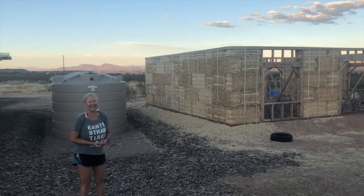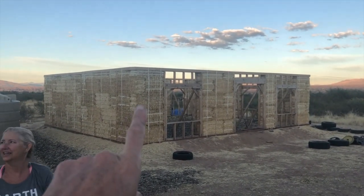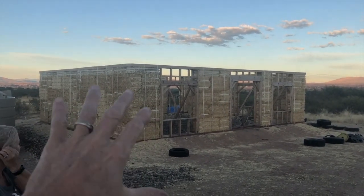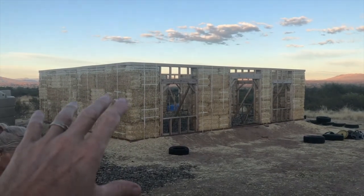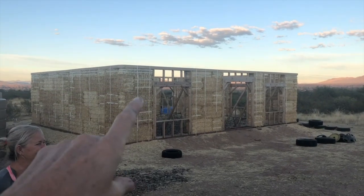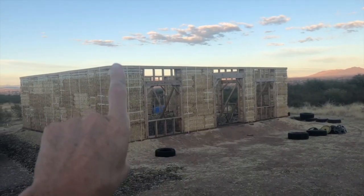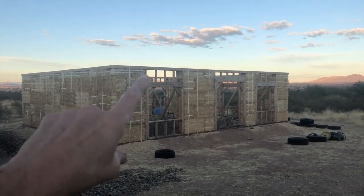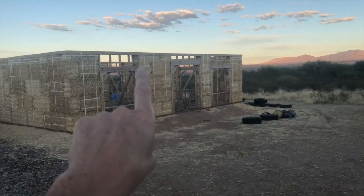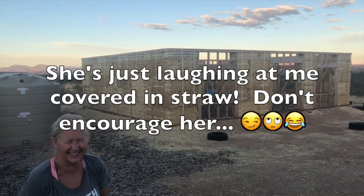It's all pulled down. There's Pam. What I haven't done, I haven't connected the king studs on the interior of the wall, but I'm not real concerned about them right now. All the weight of the trusses is going to be on the outer edge of the wall. And I'm about to build the pony wall that's going to go on this south wall right here. It's only going to be about 2.5 feet tall. And it will be on the outer edge of the wall too. So what I was concerned with was all these cripple studs and king studs on the outer edge of the wall. So it's all attached and we're ready for our next step, which is the pony wall.